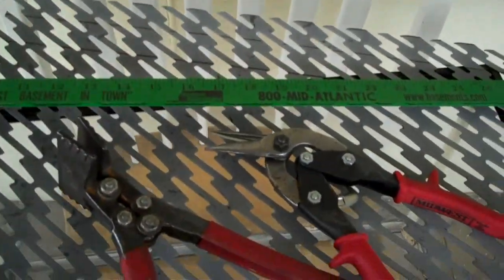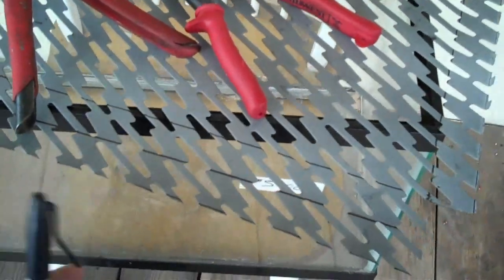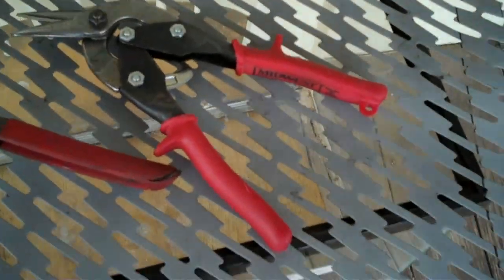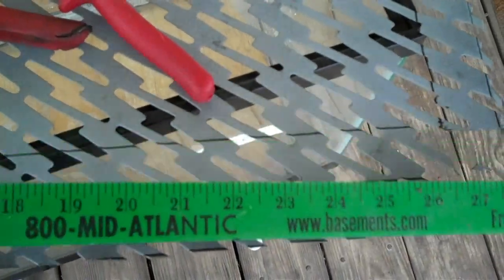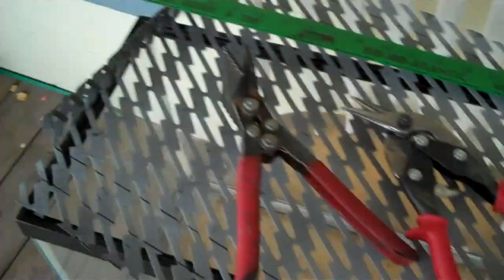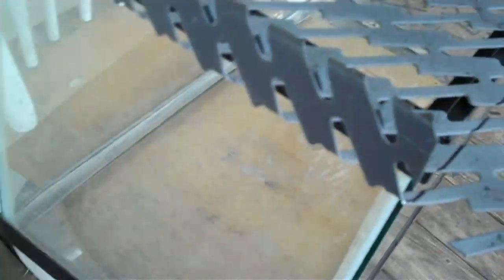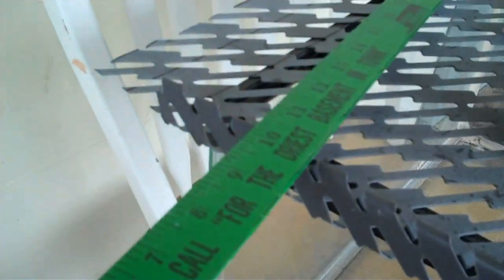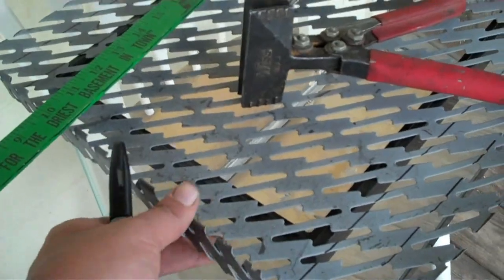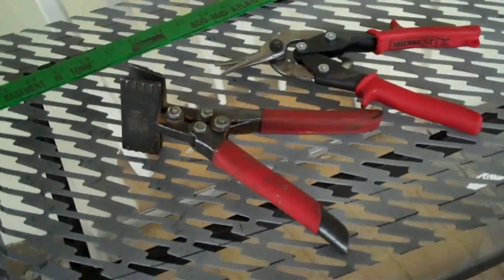So I found some metal and I marked the lines. What I did is I just sat it on there, drew all the way down around underneath with a marker, and then I took my straight edge and added one lip, two lips, and trimmed it all out. You'll see I got this side already done — I just bent it over and bent it over, and a nice little lip there, and it's not sharp.